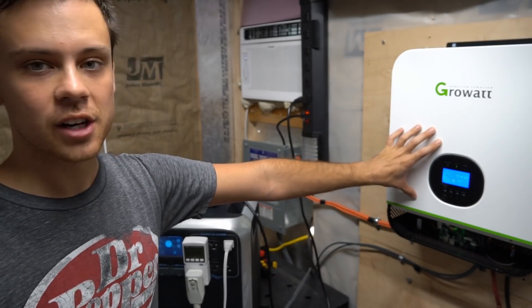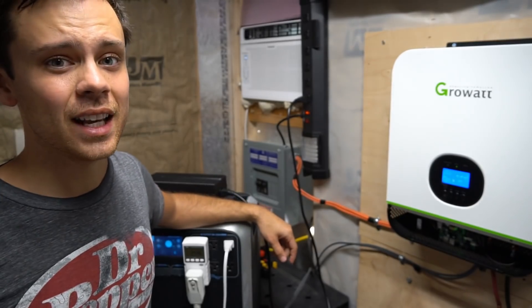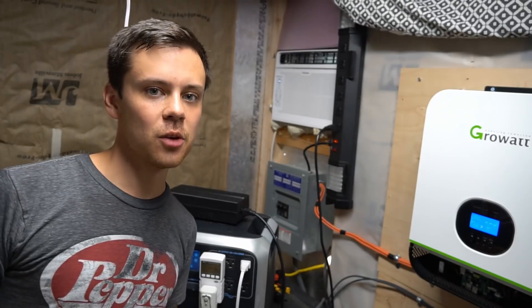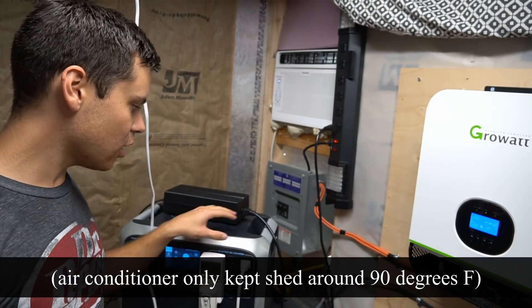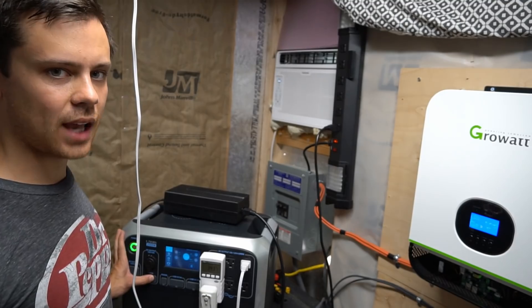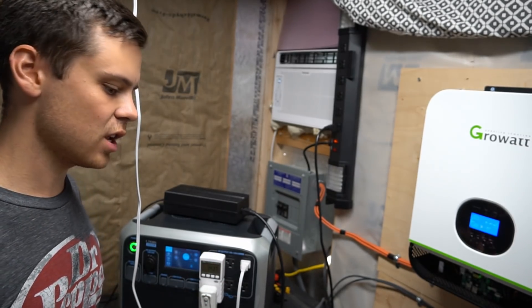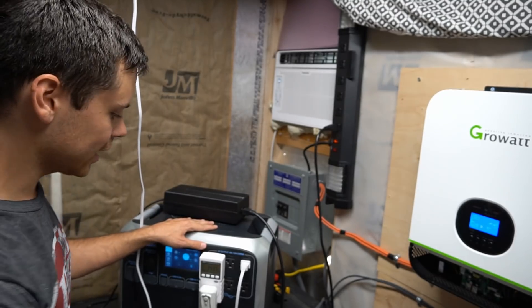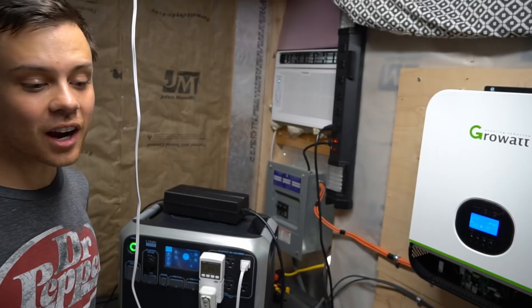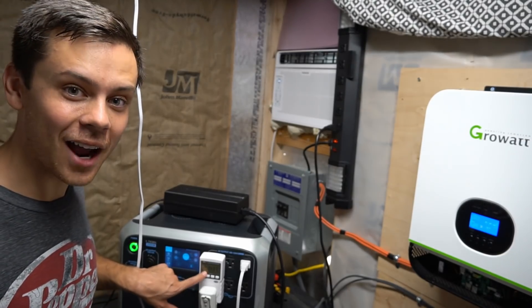I'm now using this system to charge it every day in conjunction, because running this air conditioner with how hot it is here in Vegas is very difficult — it's like 110 degrees at night. In two weeks I've pulled 34 kilowatt hours total. This shed was 110 degrees last week and we did not get an over-temperature event even though I was running this non-stop. The cooling system seems to be working great and everything else on this unit performs as advertised. The number one thing I test with solar generators is how long you can run the inverter in hot temperatures, because that's the number one fault point — you have a large inverter next to a battery and a BMS with a lot of heat generation. The AC200 has passed every test I've thrown at it, and that's very rare for me to say. A lot of these solar generators fail a lot, so I'm pretty impressed.